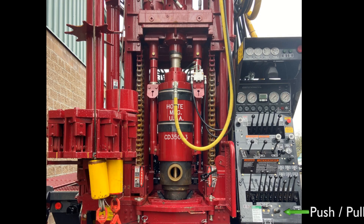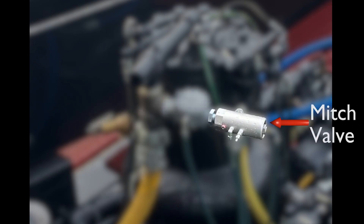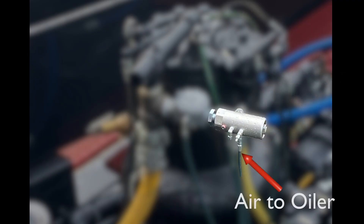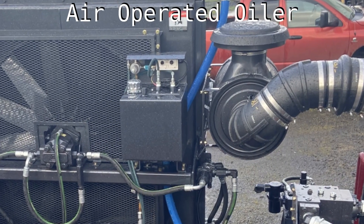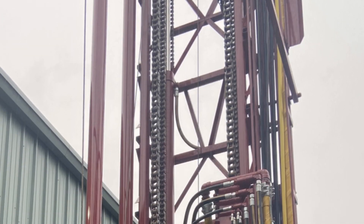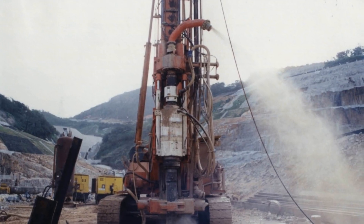When used with the accessory package, the casing driver can be installed to run from the cab or control panel. The accessory kit works by a push-pull selector valve in the panel. A pilot regulator controls a high-volume valve, which sends air to a high-flow regulator — used to set and forget the perfect air flow. This setup avoids having to finesse a ball valve or run large air lines to your controls. Some rigs will need an additional oiler depending on where your rig injects oil into the air. It's best to turn off the push-pull valve when drilling gets slow or the casing is going in smoothly. You can drill out ahead of the casing by maximizing your cylinder stroke, then hammer the casing down in situations where casing must be advanced hundreds of feet through hard rock.